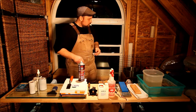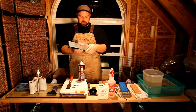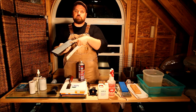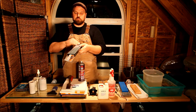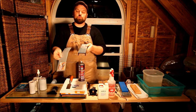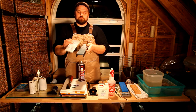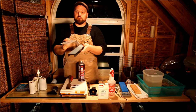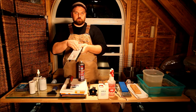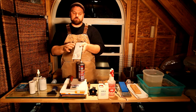There are additional techniques that use honing films. This one happens to be by Pinnacle, but there are several products that use these films. The film adheres to the top of an aluminum channel, and these come in varying microns of grit thickness. This pack from Woodcraft has several different finenesses of film — the one on here is 0.15 micron, and they get even more fine than that. Same concept: draw your tool over just like you would when sharpening, and it polishes the edge very well.